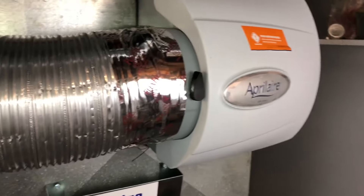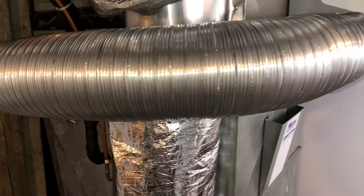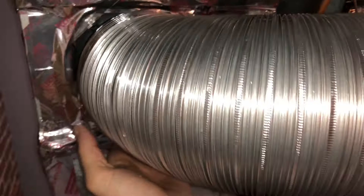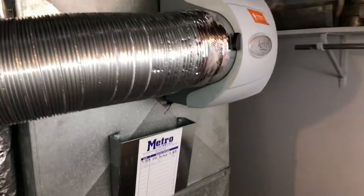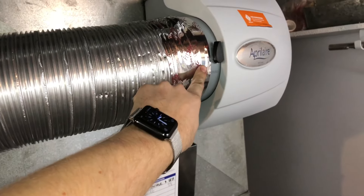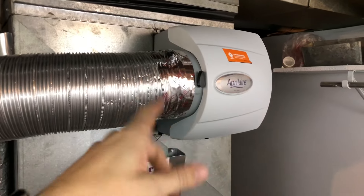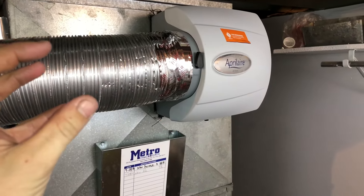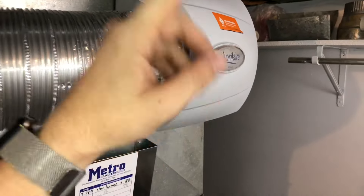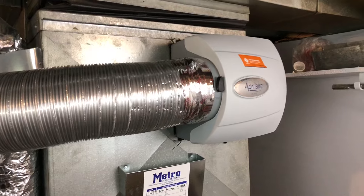There's the installed humidifier, and here's the ductwork I chose — it's just six-inch flexible duct. I think this goes up to 10 feet, which is more than I need. I've just got it over here taped to my flange and taped to the humidifier as well. It has a nice slip-over fit on the flange — it's actually the same OD as this, which isn't ideal, but this is good tape. Maybe I'll get a piece of rigid with an outside diameter that's compatible with the inside diameter of these, and then screw it together and tape it again. But for the meantime, I can still run my furnace like this, which is important.